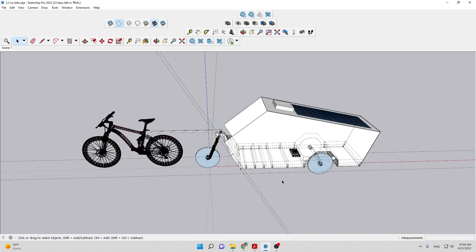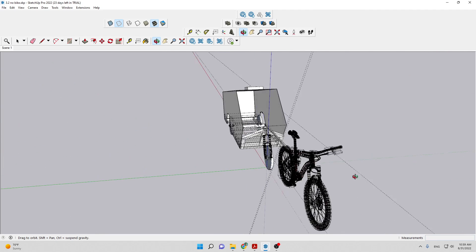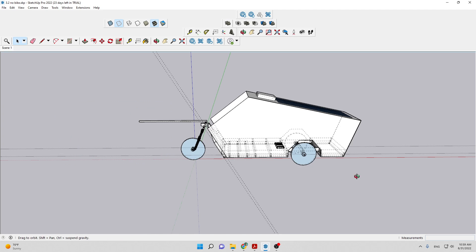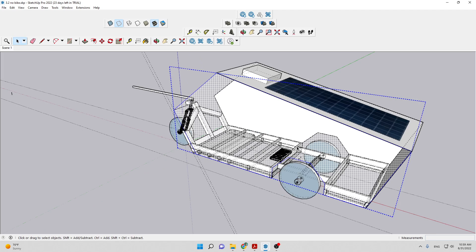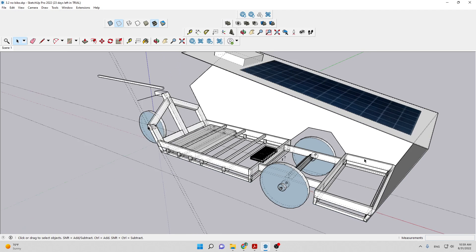Here's where I'm at — just trying to take you through the model. Haven't closed up the front faces yet, but wanted to break this down and show you where I'm at. These are one inch wide by three inches, these are two inches by three inches. All the aluminum will be 6061 T6, one-eighth gauge, point one two five of an inch.